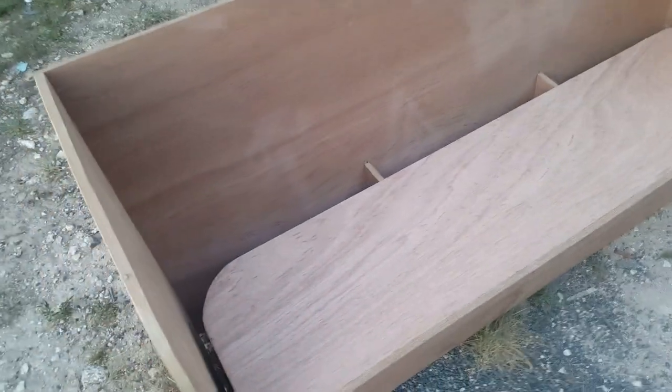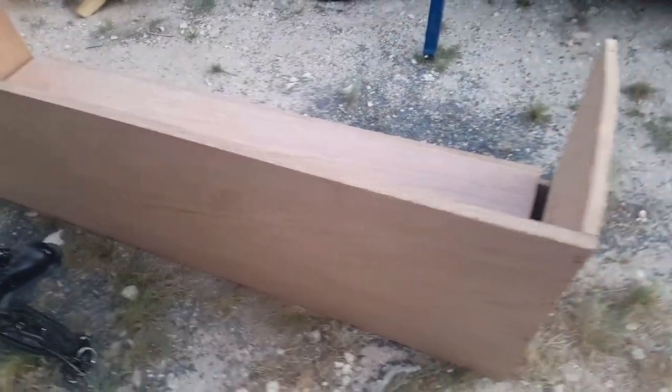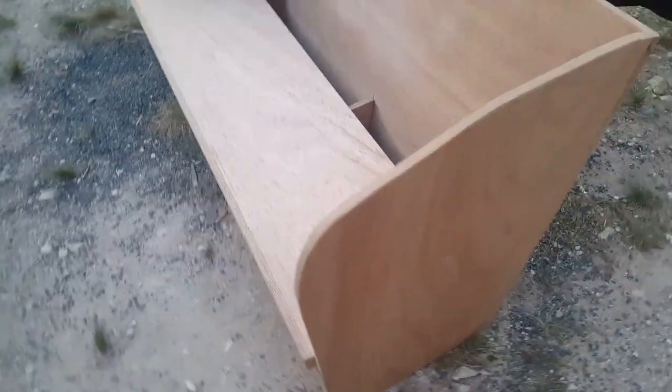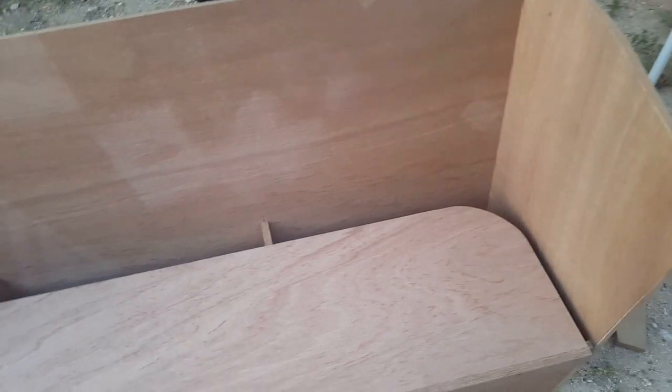I also plan on having some angled foam in the center. I left a one-inch relief on this side, and then we'll put a wedge in here so we can have some corner foam — just so if you want to lean up in there. Same thing over here as well — we duplicate that same corner — and I've got enough for three-inch foam around the back. Keep in mind this is three-quarter-inch HydroTech, fastened together with 305 stainless steel screws — no actual ferrous metals in this. We just took and duplicated the measurements of the prior boat, just made the bench a little bit longer in the back so it will utilize more space.